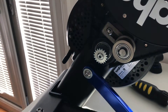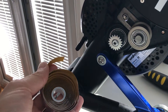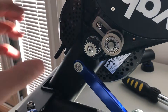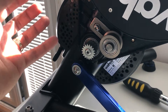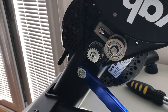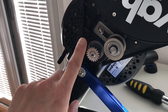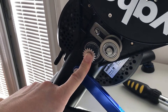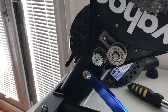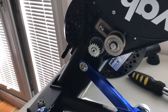So if I just give it a little spin you'll see the flywheel naturally wants to sit there - clearly this flywheel is spinning around at very high speeds and yet it's off balance quite clearly. I've been on eBay and bought some lead tape - it's self-adhesive and they sell it as golf club weights. I really wanted to get inside the flywheel to mount a weight internally so it can't go anywhere, but it looks like I'd either have to cut a hole or dismantle the bearing, which I don't want to do. So I'm going to tape it to the outside using a band of tape around the outside.